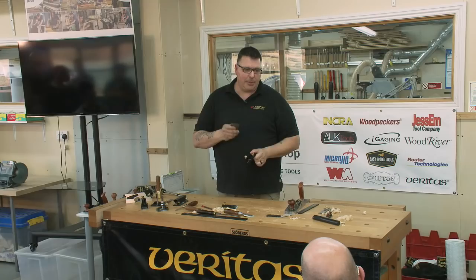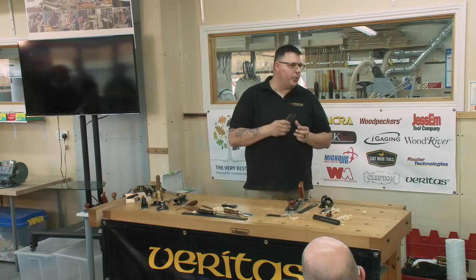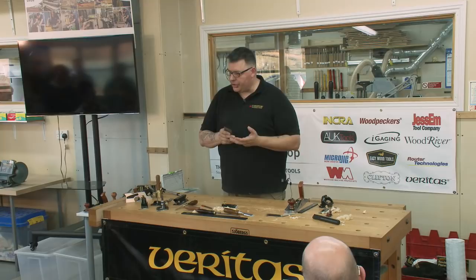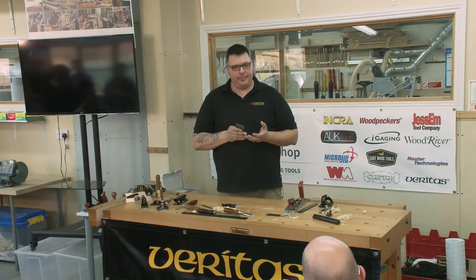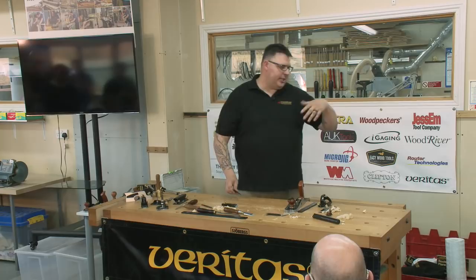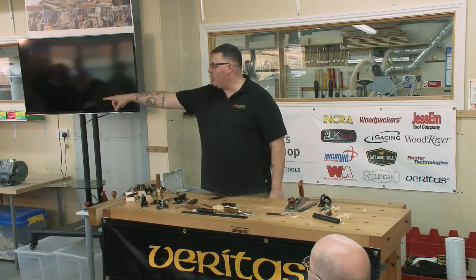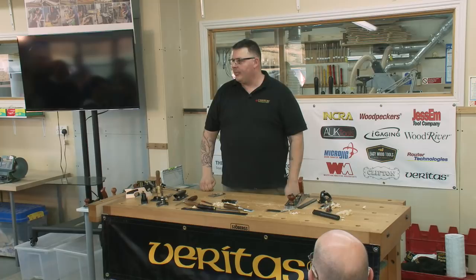It's not slow — it's repeatable. The only thing you're trying to do when you sharpen is get two flat, highly polished surfaces that come together at an edge, repeatably. That's all. You could use a jig or no jig, diamonds, oil stones, water stones, sandpaper — even a rock from outside, you'd just be at it for a while. Remember that fundamental: two flat highly polished surfaces that come together at an edge, repeatably. Then you'll never have a problem.